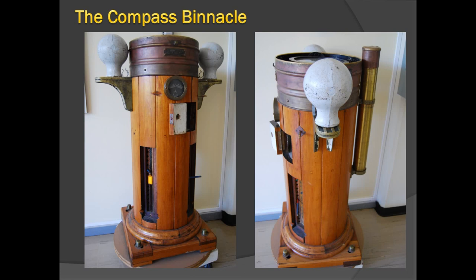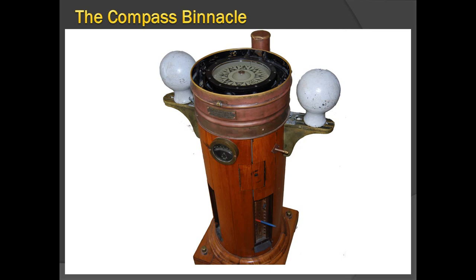Iridium is used to make the pivot — it is the jeweled underside of the float. It is very hard, not brittle, and highly corrosion resistant, which is why it is used in magnetic compasses. This is what the compass binnacle, or Kelvin's compass, looks like. Photographs are shown here, and a video is planned to give a closer look at the actual instrument.